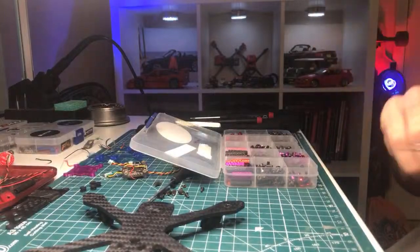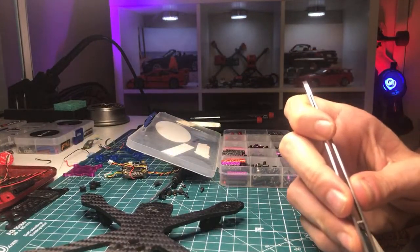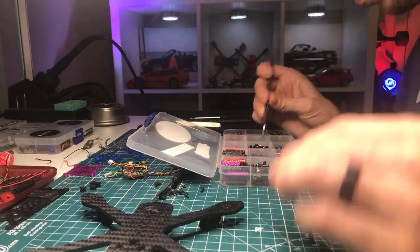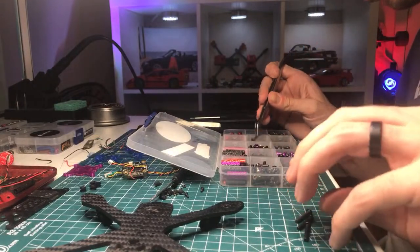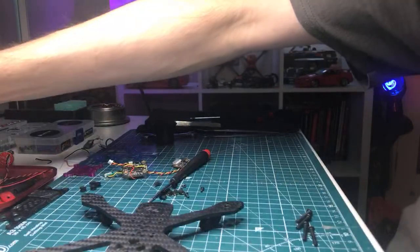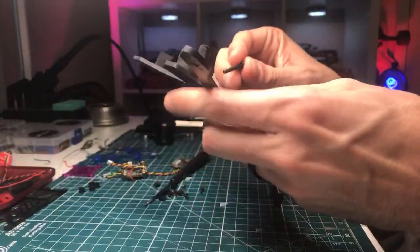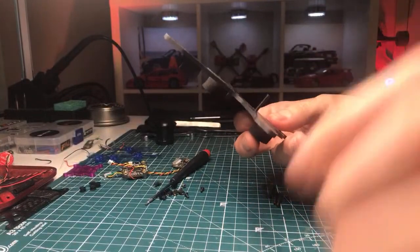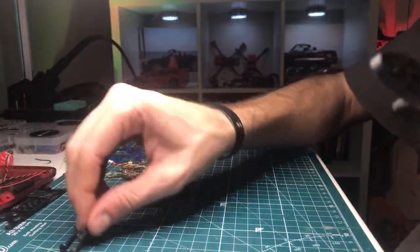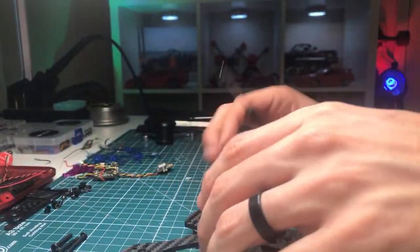We're going M3. I'd love to go M3 on the stack mounting, because they're more available, and the grommets work a little bit better, which I will explain in a moment. This is also good because I'll be giving Jamie something with a couple less M2 pieces of hardware. Actually, no M2 hardware other than the motor screws, which is kind of a pain. That's one of the pains in the ass when you start to get into micros, is that they use different hardware. They use M2 instead of M3 hardware. So you've got to get a whole new hardware set. It's just a big thing. So let's get this out of here. You move out of the way, little fellas, little M2 pains in the ass.